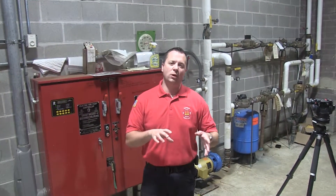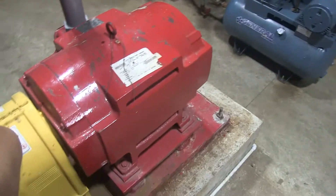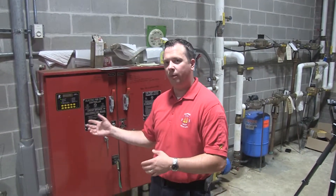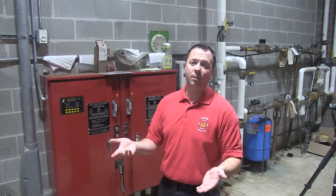The fire pump looks big and complicated, but it's just here to add pressure. If you try to shut down a system that has a fire pump, it's important to also shut down the fire pump. Remember, it runs off of pressure — when it senses low pressure it will begin to run. So if you shut down the water, it's going to sense low pressure. These are called sacrificial pumps — kind of like our fire engine, once we engage the pump, even if it gets low oil or high temperature, it will run until it explodes or somebody shuts it off. So it's important that we shut it off. You have to shut off both the jockey pump and the pump controller, because they will continue to run until they achieve the pressure they want — and if we have a vent in the system, we're not going to be able to achieve that pressure.